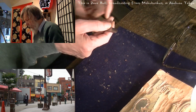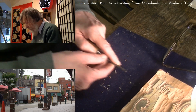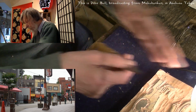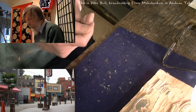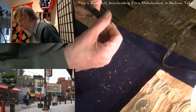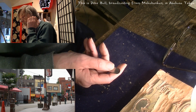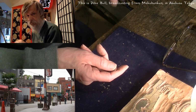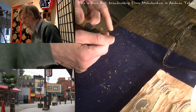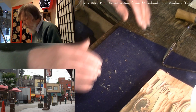Then once your initial groove is done, as you're running in your little groove, you roll your chisel side by side, the groove itself starts to deepen, and over the next months and years, you've got yourself a perfect little stone for this. The 1000 or 1200 does the same thing. I wouldn't dream of trying this with a finishing stone. They're so rock hard, you could maybe make an industrial process and do it, or just buy one.